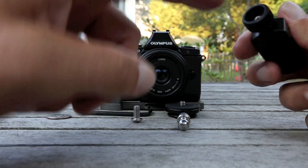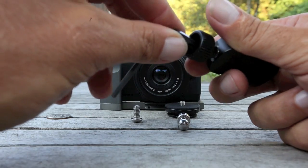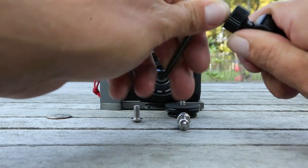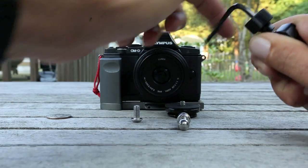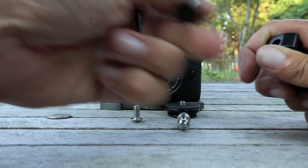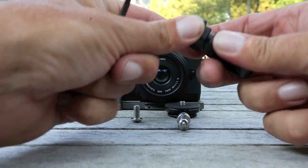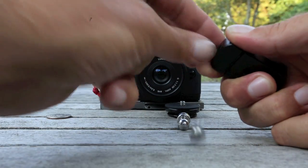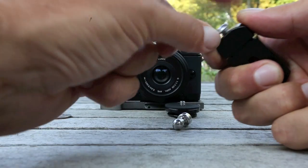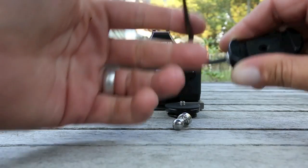What you do with it is there's normally a black plastic cover right here. I've already removed that with a piece of sharp, like an awl. You then take an Allen key and you just spin that out because it's an Allen bolt that's bolted in there. Be careful when you do because there's two springs in there. You then replace that. It's a 1/4-20 thread. You replace it with a regular hex head screw like that.